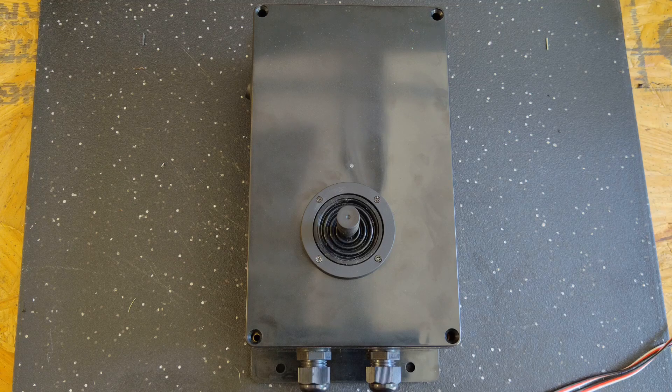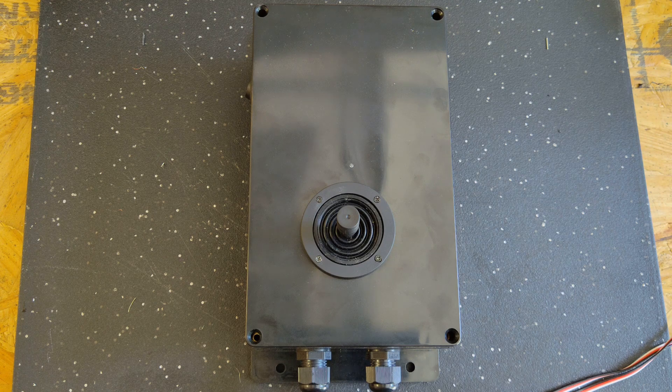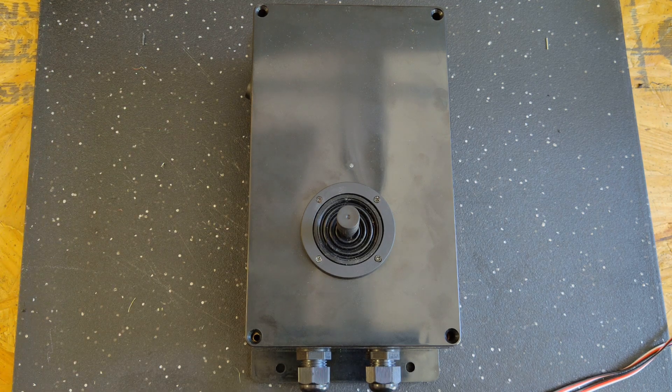This is a view of the exterior of the box once I put everything back together. It may seem a little bit large — you could use a smaller one, but I liked it because there was a lot more space inside to get all the components in there without smashing everything together. By using this two-axis joystick, it allows me to not have to install a kill switch, because once you let go of the joystick it returns to zero and your kayak or whatever you're using this on is not going anywhere. You could use just a single-axis joystick to control the steering and then use a standard knob controller for the throttle, but then to be safe you would have to put in a kill switch. I do have an on-off switch that goes to the power input for the servo motor. If you have any questions, please leave them in the comments. Thank you.